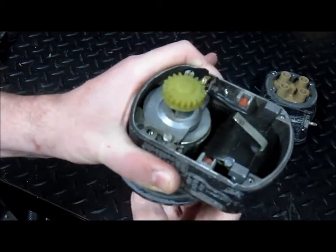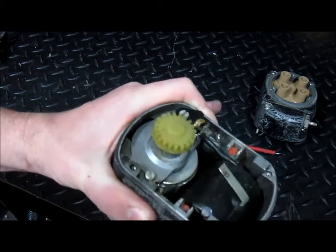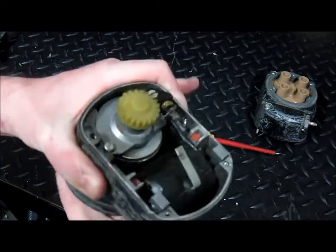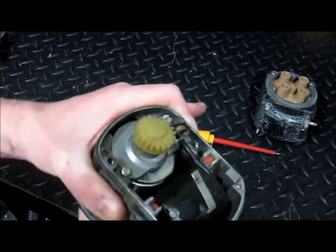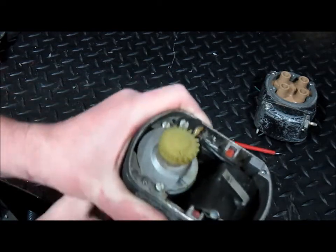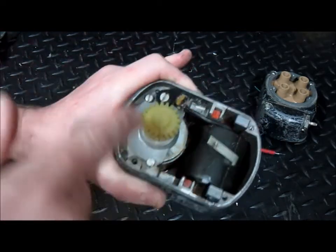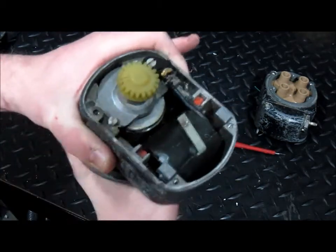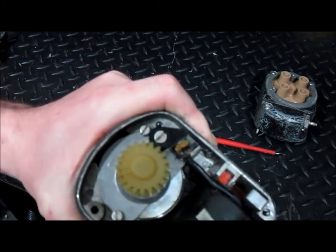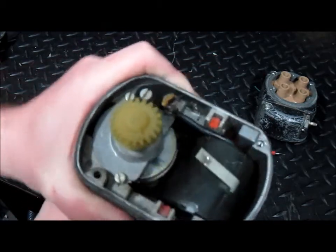Watch this now. So as you're rotating the engine at about 50 RPM, and we need about 150 RPM at least to generate enough current in that primary coil — that's exactly what this is doing. It's winding up and then spinning really quickly, winding up, spinning quickly, winding up, spinning quickly. And that is an impulse coupling.